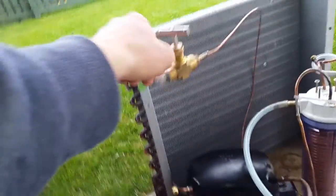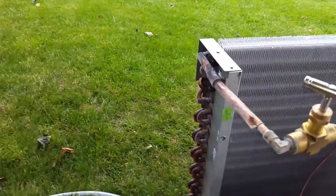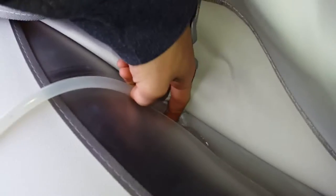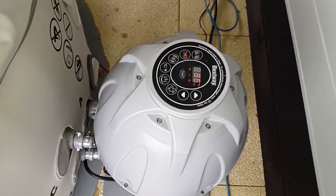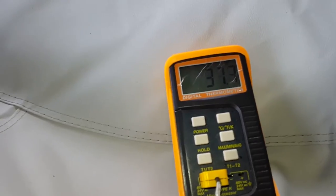Here I am over at the hot tub — it's running quite well. I've restricted the needle valve a bit because the evaporator temperature was a bit high, so now we're going to get a little bit of frost formation, and it's dropped the power consumption of the compressor a little. The compressor is just nice and warm to the touch. The temperature of the water coming out the heat pump is currently 43.2 degrees Celsius, and the water going in is about 35, though the temperature sensor tends to jump about all the time. It seems to be about 37 to 38 degrees in the hot tub.